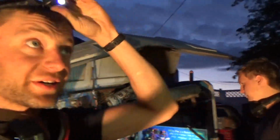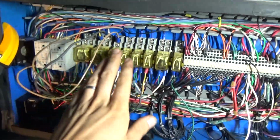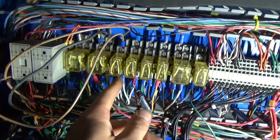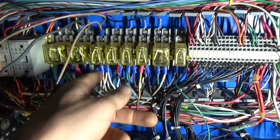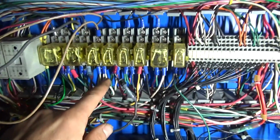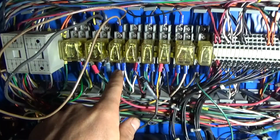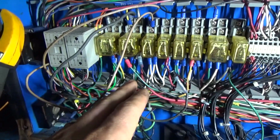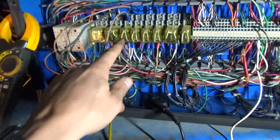Okay, this is when it gets hardcore. So, putting all of the pieces of the puzzle together. The main problem with this relay is that we have voltage here when the tractor is running. And what is the voltage? It's 10.5 volts. So on the feed to the relay, battery voltage is like 14, and this is 10.5. And that 4 volts is enough to keep the relay from going into its normal run state. That's how sensitive these things are. 4 volts across, and it will not switch when it's supposed to.